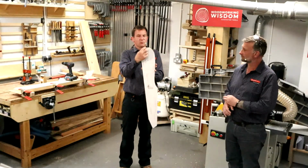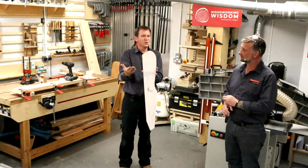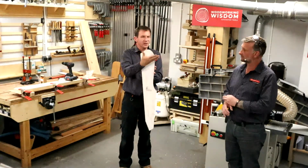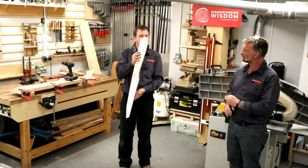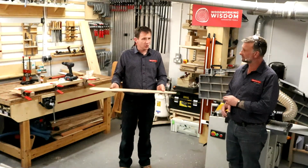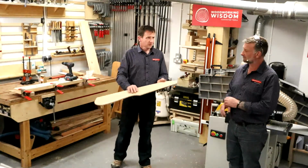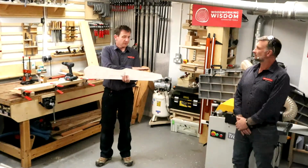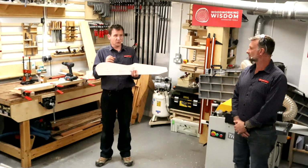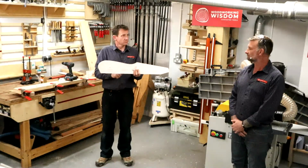You've got to come up round somewhere. So end grain, it's got support. The minute you go down this curve, you lose it. You've got short grain going against it. It's going to flick out. Come down here, you've almost got to turn the template over and work from different sides for different positions. It would be lovely to route them all. All right. So if that's what you're getting at, that's the thing. If it's shaping the template, would it be an MDF? Really easy to cut on your bandsaw, jigsaw maybe, and then hand sand all this in.